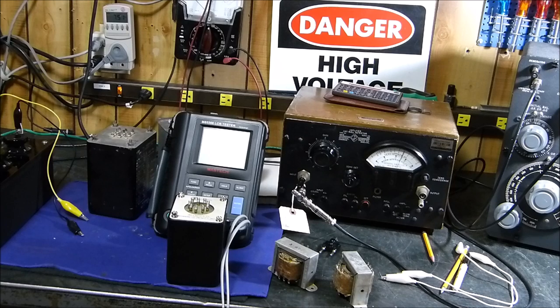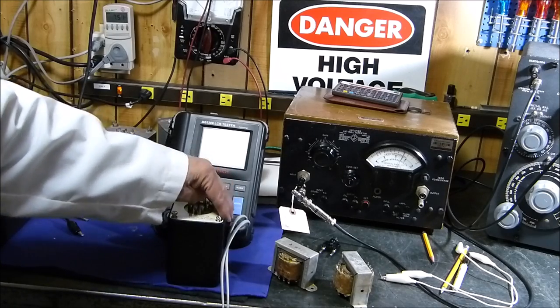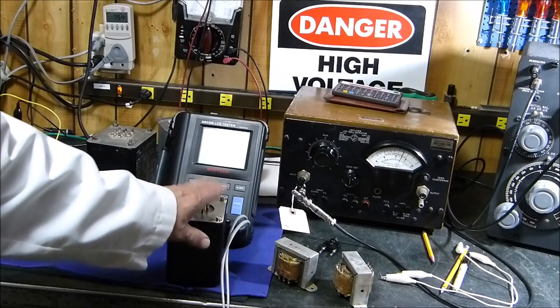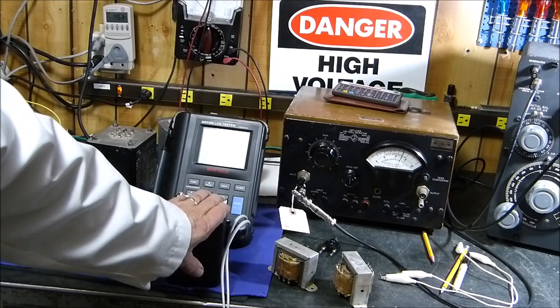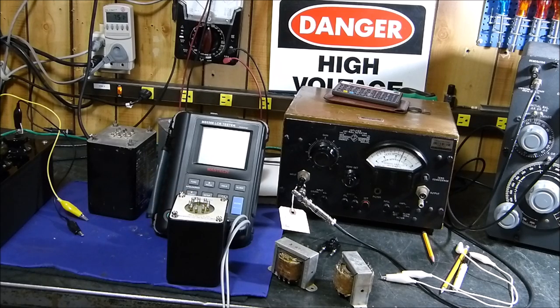The best fit that I can get to it is a second degree equation called a quadratic equation, a parabola. It is not linear. So if you have an exact 8,000 ohms to 8 ohms, that's a 1,000 to 1 ratio. If you change it to 4 ohms, it will not exactly halve. If you change it to 16 ohms, it will not exactly double. And the difference in just a 2 to 1 ratio is acceptable. But once you go past that, it's not going to work very well. Even in a 2 to 1 ratio, where it should be doubled or halved, the error is at least 25%. And once you double that again, the error gets to be over 50%. So you can't stretch it but so far.